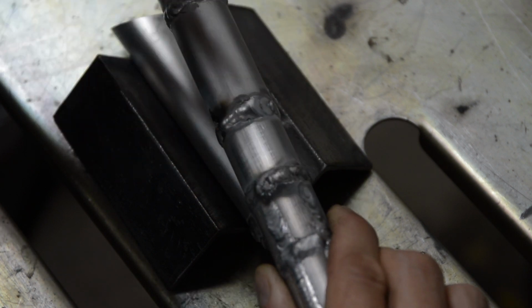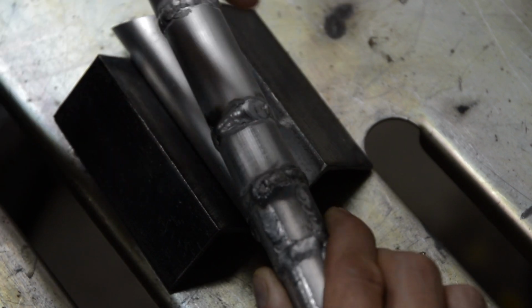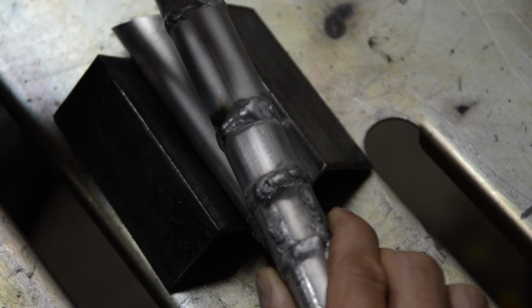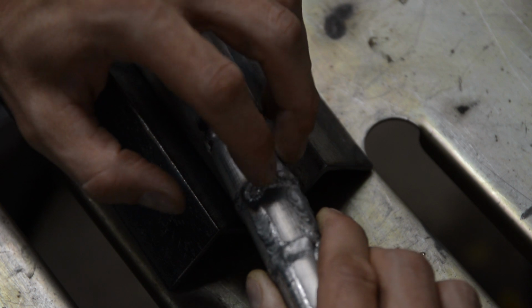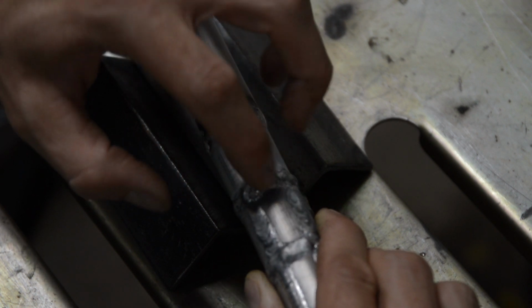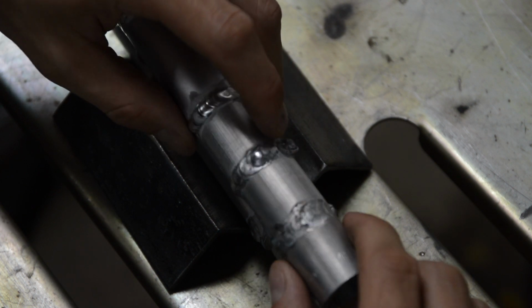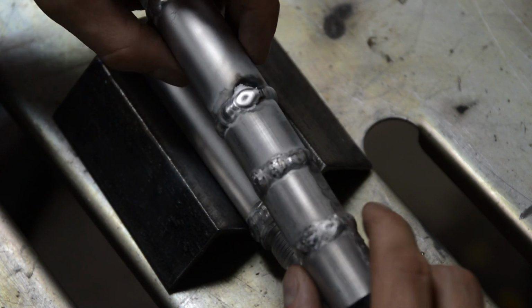So I'm just adding heat, and it's not good. You definitely want to spend a little bit of time to clean, but then you want to hammer the pedal a little bit, like 60-70%, and get a puddle formed, and then you go. So it was just technique. I was screwing it way up.